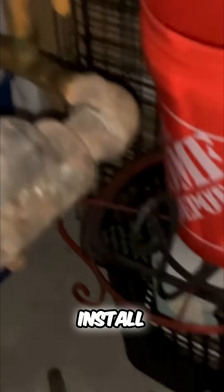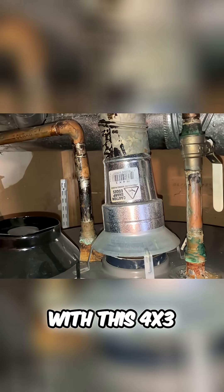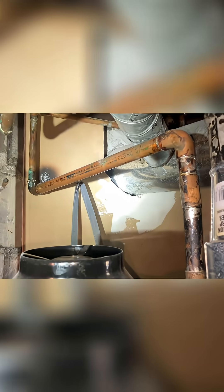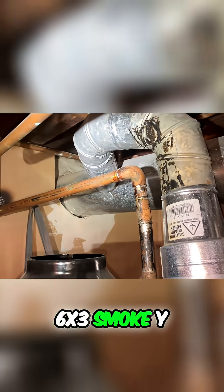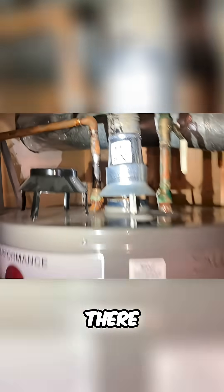The diverter — not too shabby. We have some knuckleheads who installed this system: a one-two-three zone boiler with the water heater installed using a four-by-three reducer, and there's a six-by-three smoke Y there.